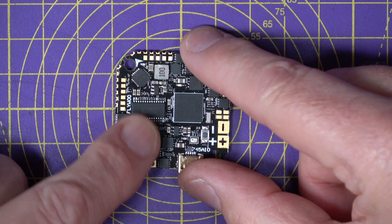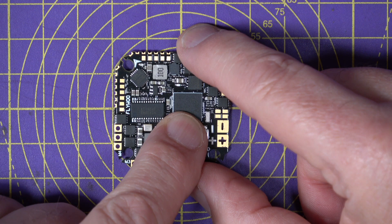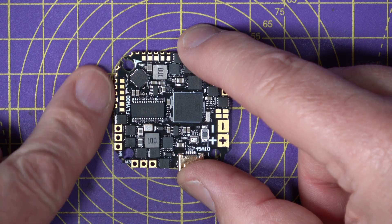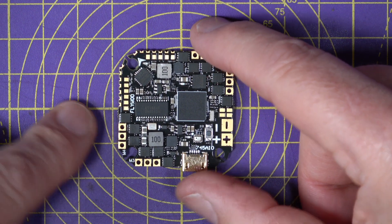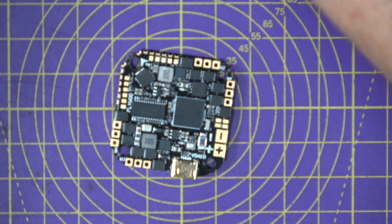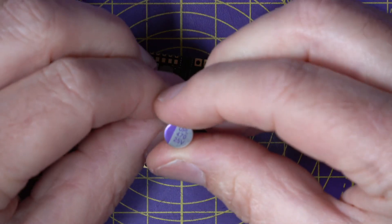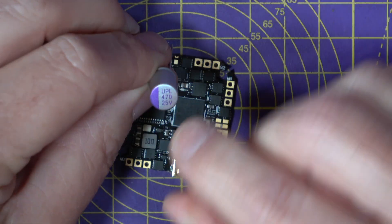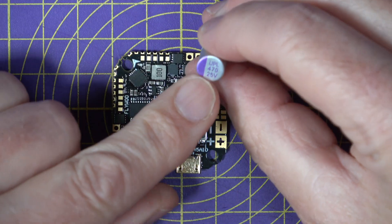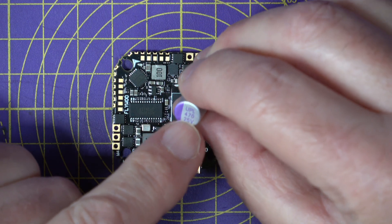This 1.2 version has been redesigned with larger pads on the PCB connectors as well as 1 meg flash on the STM32. It's still a bit tight on the edge connections. In the box you also get soft-mount gummies, a pre-wired XT60, and a low-ESR 470 microfarad 25 volt noise suppression capacitor. That's fine for 4S but marginal for 6S — I'd replace it with a 470 or 1000 microfarad 35 volt capacitor to be safe.